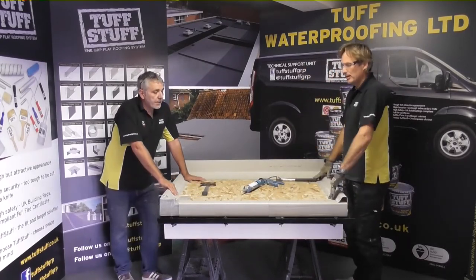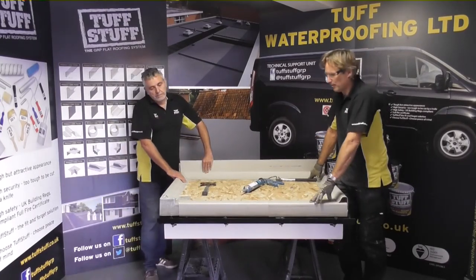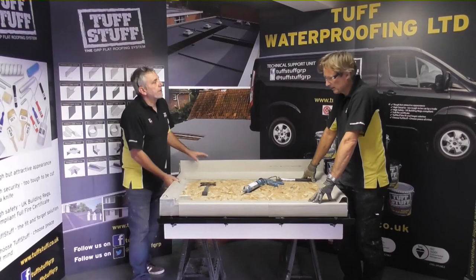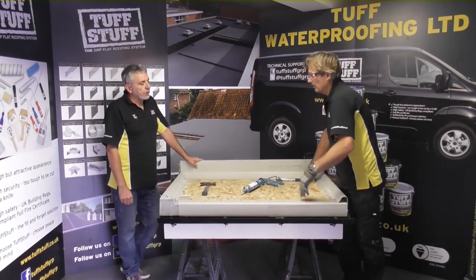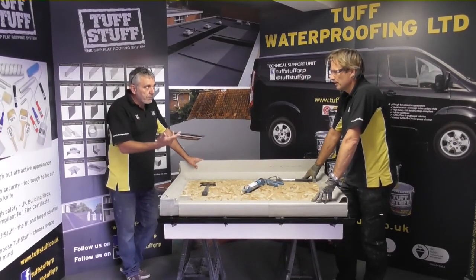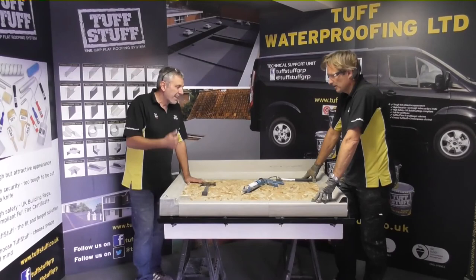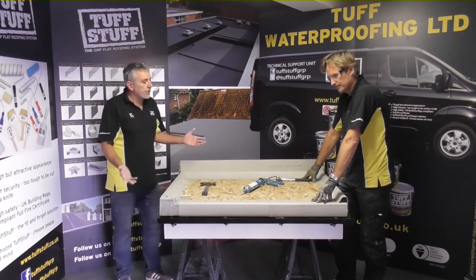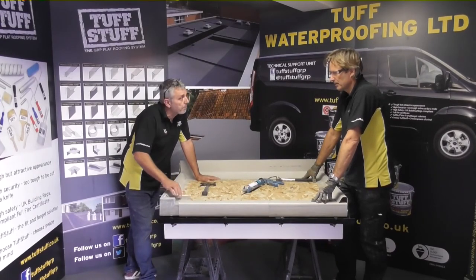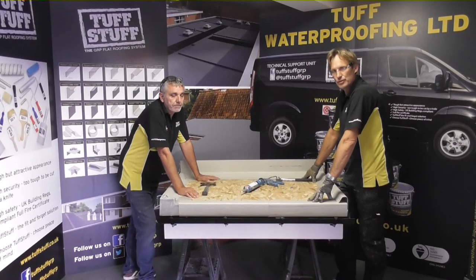As you can see, once you're bouncing into position it really doesn't take long to cut and trim up a roof. Now with all of these preformed trims, we've got a really crisp, clean perimeter to the roof — it's going to give it a really good look, all sealed up, belt and braces on all the trims. From here, what we want to do now is get everything off the roof that we don't need, give it a really good sweep, get rid of all the dust, and then we're in a good position to start the next stage — which is where we start to bandage all the joints, dressing our corners and our overlaps on our trims. Join us soon — see you in the next episode.